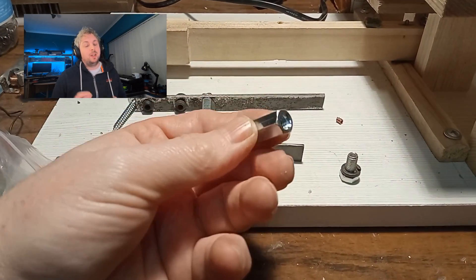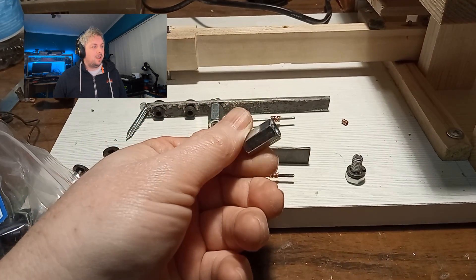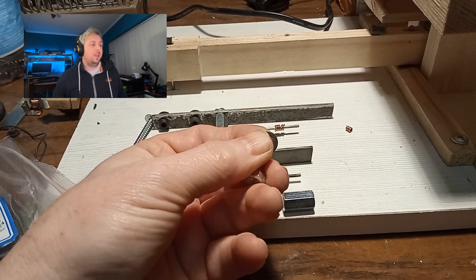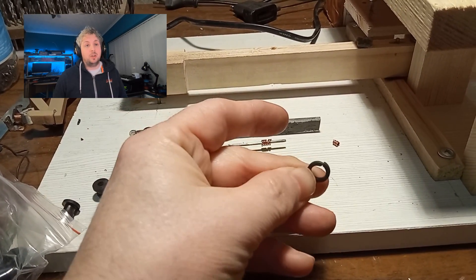That was the first collection of videos I got sent. I was really curious — I wanted to know if they'd managed to make a full tone generator assembly, and then I received this next selection of videos. This shows how we're going to try and make that central block. In my design I need some brass square section, which involves a lot of drilling and tapping and it's a lot of work. Here we've come up with the idea of using a long nut that's already drilled, already tapped, and already quite a hard material.